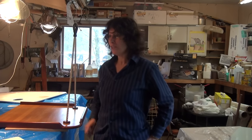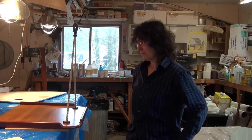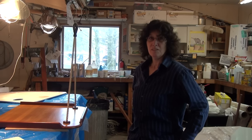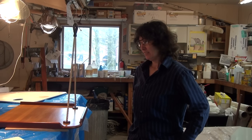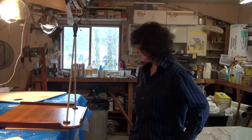You made a little boo-boo on the one on the corner — you forgot you were going to fiberglass the edge. We got all excited about laying paint on the other side, coat after coat, piece after piece, and we kept laying paint all the way down to the edge, forgetting that we're going to be epoxying it in. We wanted to leave the epoxy primer exposed. No problem — we'll just sand the paint down, it'll be fine.